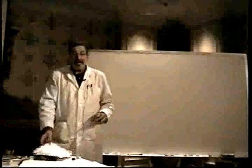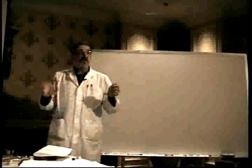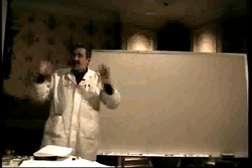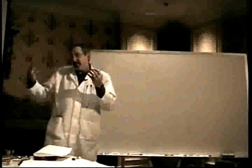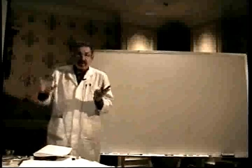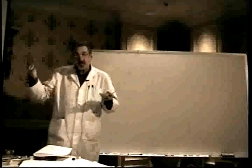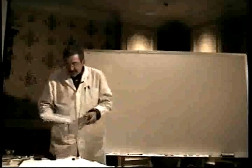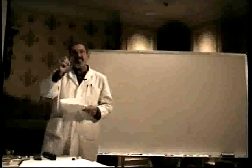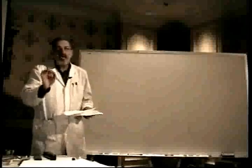Now, it can even cause a dim picture because in many monitors, when it goes out of horizontal sync, the monitor kind of shuts itself down. It doesn't exactly shut itself down, but it kind of diminishes the output of the CRT in some cases because it's not synchronized and it just doesn't know what to do. The thing is this, what's interesting about this is this.